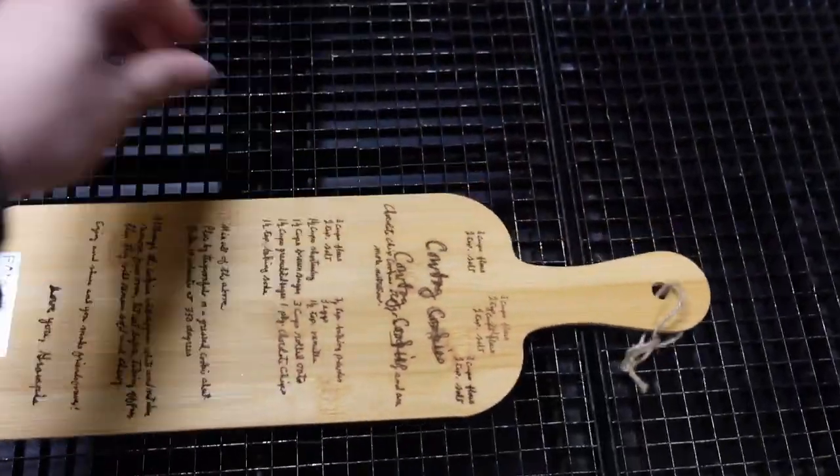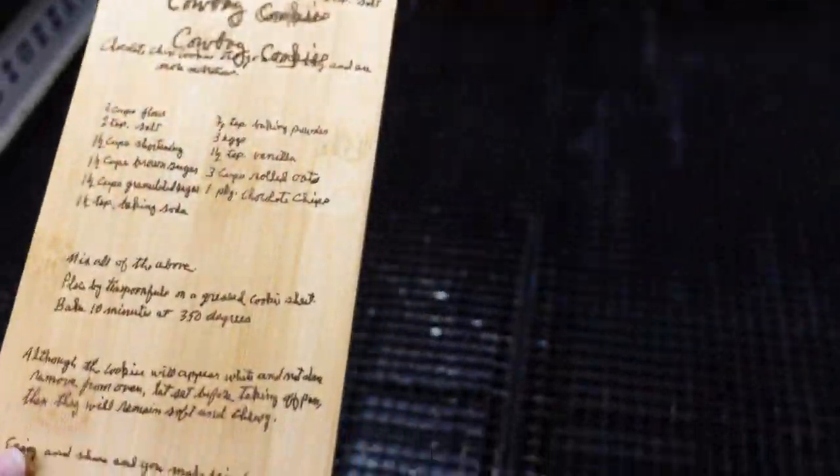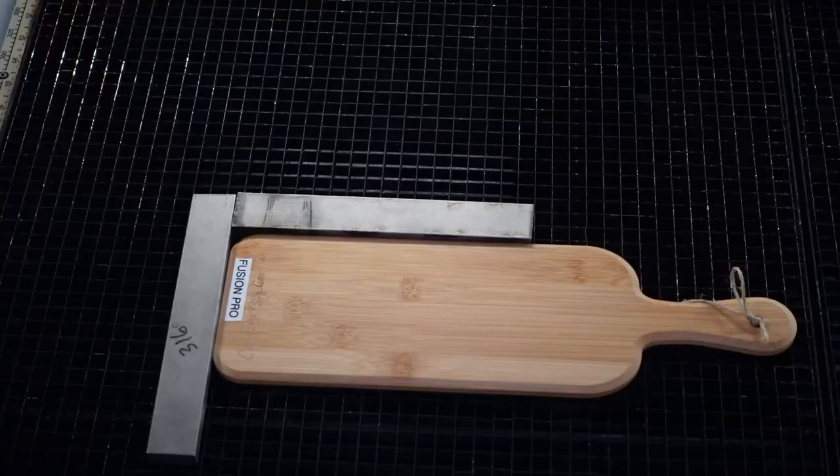But I'm expecting that with this machine, if I turn the board sideways and it's just scanning back and forth, it's going to go so fast it'll probably take a fraction of the time. So let's see how long that will take. We're going to run at 100% speed and 40% power, and the estimate is 4 minutes and 30 seconds — basically less than a third of the time the Creality would take.